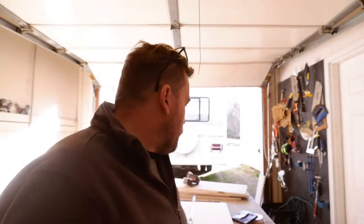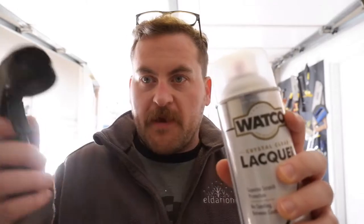The first round of sanding is done — probably two more passes and then we're on to finishing. One more change to the plan: I decided to try spray lacquer for the tabletop. I like lacquer a lot. I've only used brush lacquer before, which is kind of a pain, but it dries really quick and you can get a lot of coats. With a spray gun attachment, I should be able to put down many coats rapidly. A coat every 30 minutes instead of a coat every day for five days — and it should be in the same tier of durability as poly.